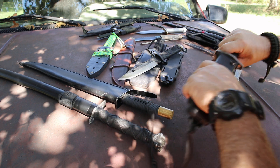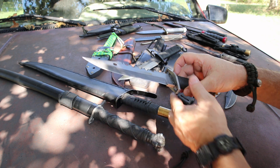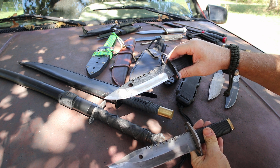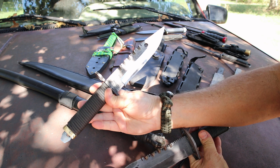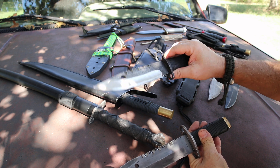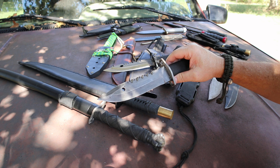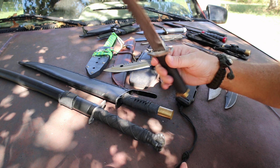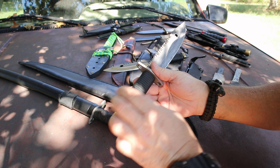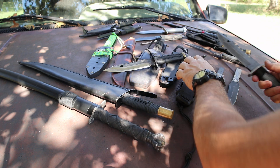This is what I call the Snow-Tac 7.5. This one is made with an EOD handguard — I get these from Mosby's. The next one is going to have the EOD handguard as well, with a more advanced and aggressive hollow grind down to a quarter-inch secondary cutting edge. This thing is seriously razor sharp — 5160 steel. I do an aggressive hollow grind down to about a 10-degree secondary cutting edge with a clip point. The upper swedge is also sharp. Seven-and-a-half-inch blade, full tang, 18 feet of 550 paracord. Three holes in the tang so jimping could be added. We've got the multi-function pommel. These are very cool knives.